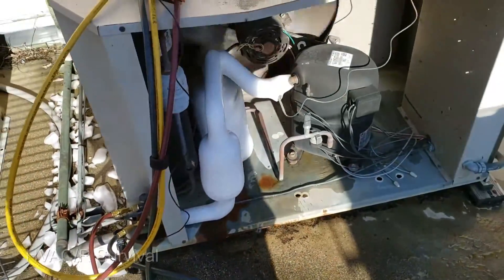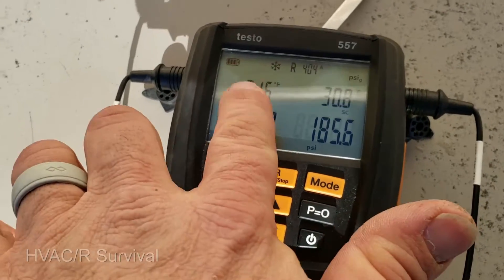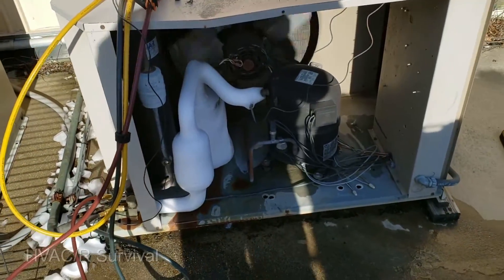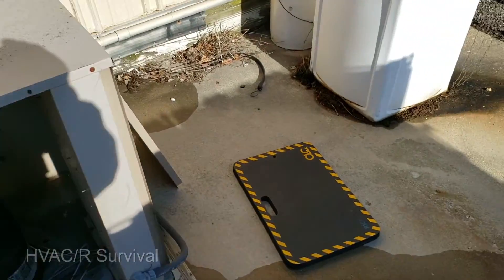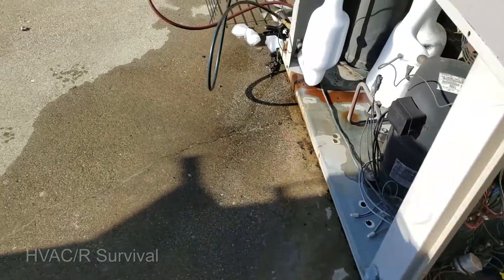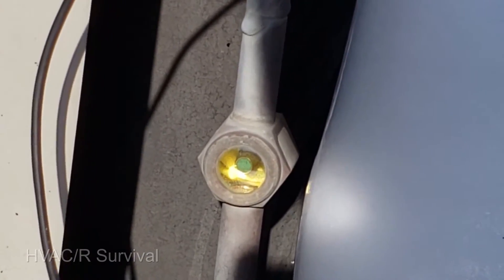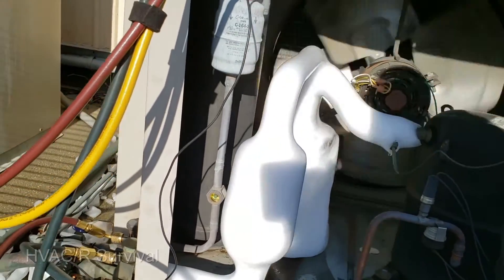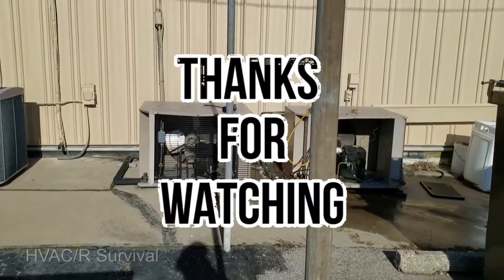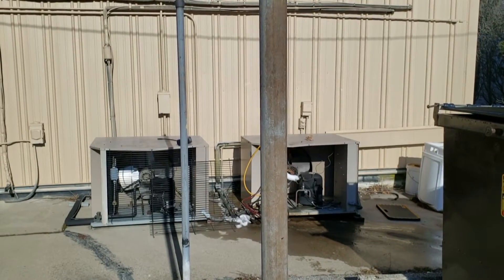Looking at the results: we have a 21-22 degree superheat at the compressor before the accumulator — we had none before, or even negative. I'm focusing on superheat here. We've got about 25 degrees, which is usually what they call for as the minimum for the compressor, so it's doing much better than before. This compressor was replaced in 2010 and seems to be operating fairly well. Look at the sight glass — we've got a full sight glass now. The reason it was dumping all the refrigerant through the coil is that now it's metering correctly, holding refrigerant back and keeping a full sight glass. I'm going to scan it for leaks just to be safe, and then order those defrost termination temperature sensors.